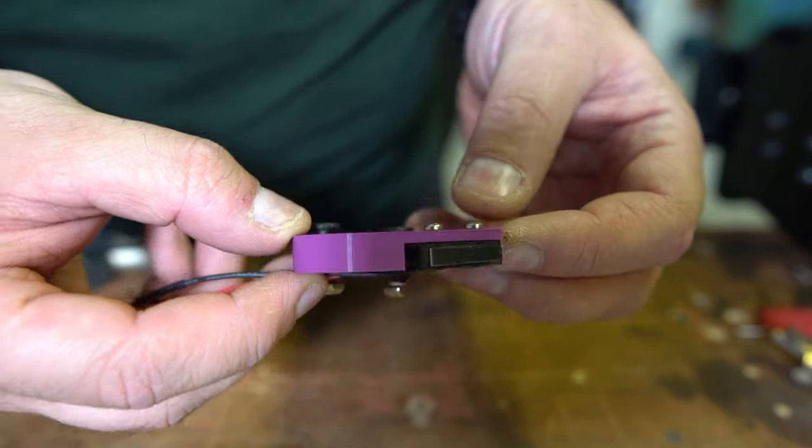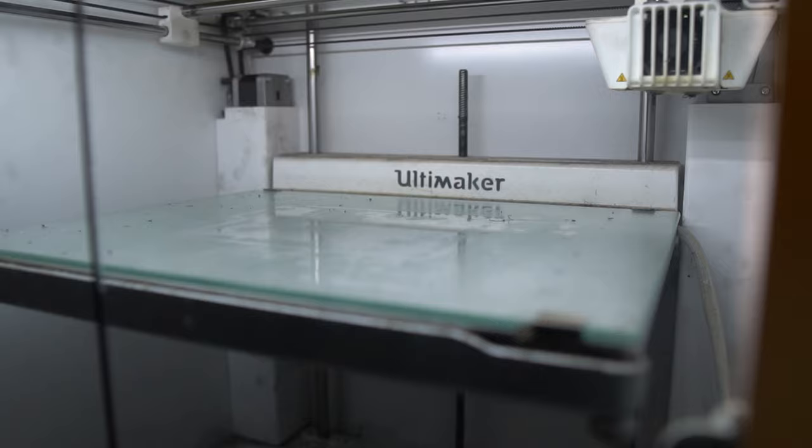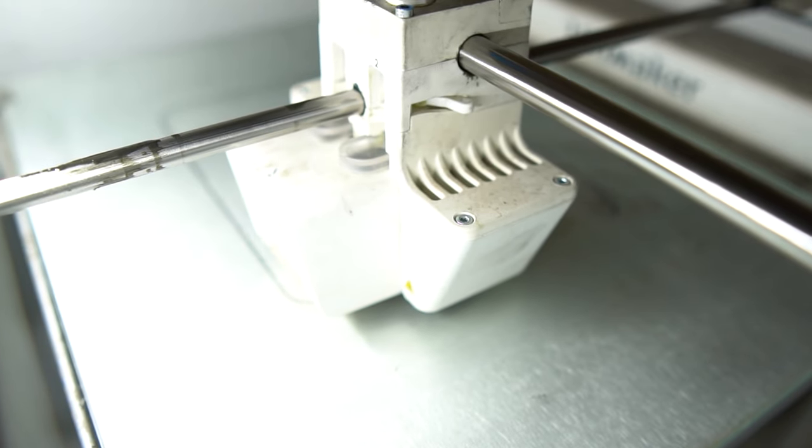I made a bracket for the X limit switch with wiring management, another for the Y, and I used Raymond's idea for an arm that hits the limit switch on the Z-axis. Having the Z-axis limit switch in its new location is amazing — the one on the WorkBee is in a terrible location, so moving it is a really nice upgrade. I want to point out that you don't have to print any parts yourself at all — everything needed to make the machine work is included in the kit. I have the luxury of a 3D printer so I can customise things as I go. If you want any of my parts, there's a link in the description to find them on Thingiverse.